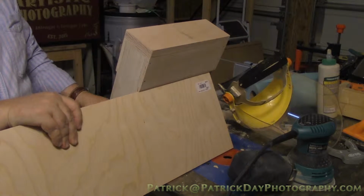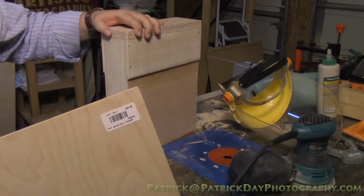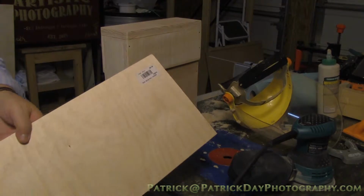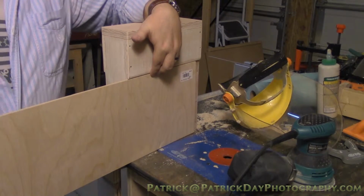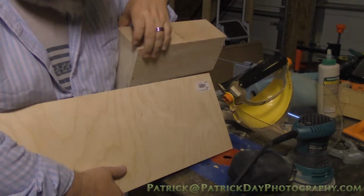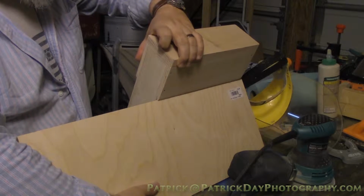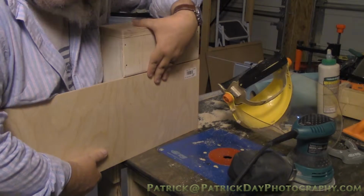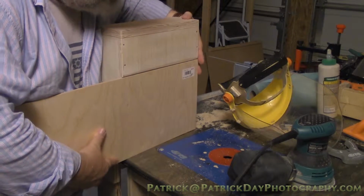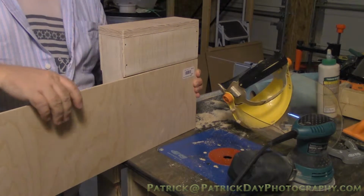it in place. And it just so happens, here's serendipitous, I've got some really nice plywood. This stuff is straight and strong, this is Baltic birch ply, 6mm, and it is perfectly flush right there. So if I were to put a hinge right there, and then some sort of catch so it doesn't go too far, I will have my leg on it, and it folds up perfectly flush. That could not have worked out any better. So I'm going to cut this. I think I got a hinge or two in the toolbox, and apply it and see what happens.